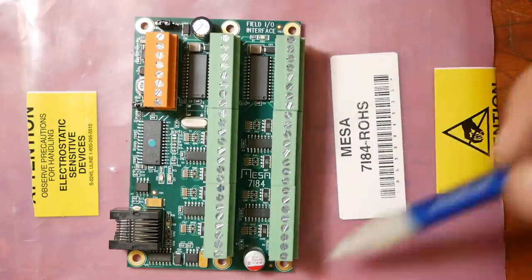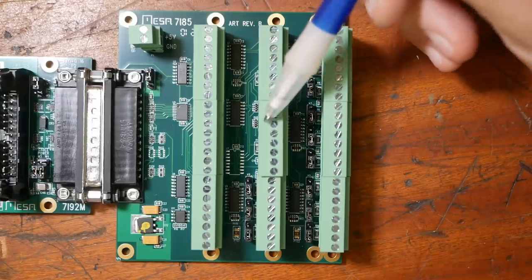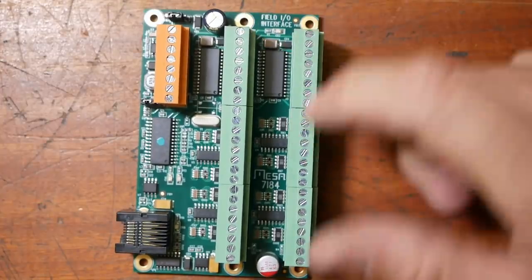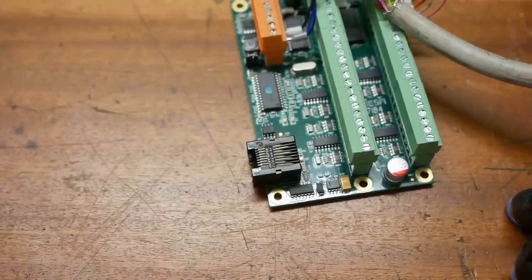All of the smart serial daughter cards connect to their mothership through an RJ45 connector, and on the other end the wiring goes into a terminal block. I'm going to connect this card, the 7i84, to serial port number 0. So I have to butcher a few network cables to get the signal into here. I need a network cable.